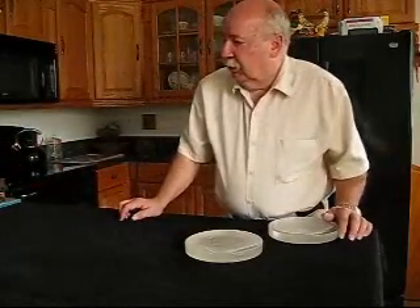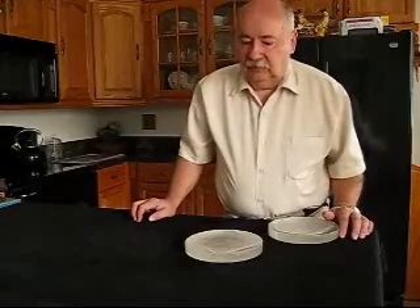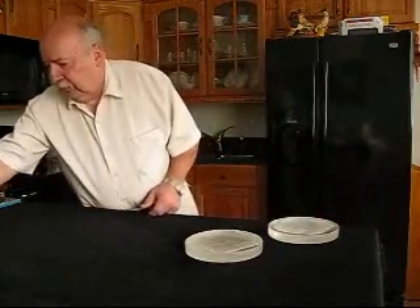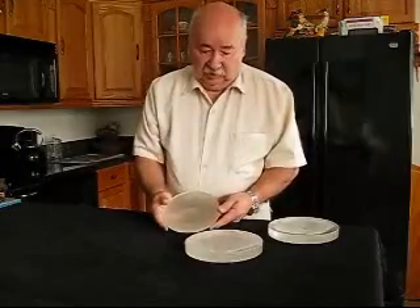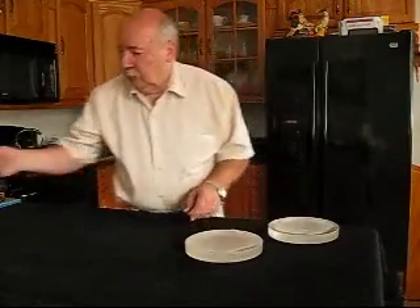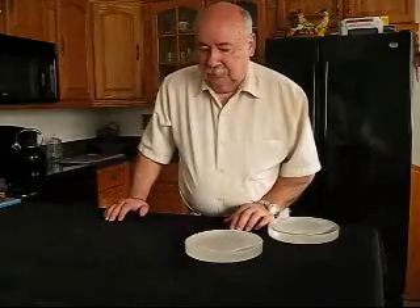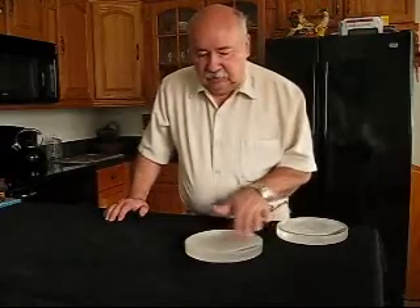And that is to replace the ceramic tiles with pennies. But you can't generate the curve that way — you need to use a different way of generating the curve. Now, the best thing to do is actually get your blank generated from your glass suppliers. I know United Lens and maybe Newport Optics and other people will, for a little bit of extra cost, generate the curve onto it — kind of like this. Already pre-generated curve. This is a conical blank, and that's very nice and saves you a lot of work, but it's a little more expensive. So if you really want to do it by hand, I would go with the plaster tool with pennies, but we still need to generate the curve.